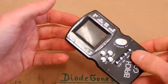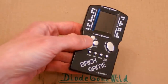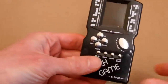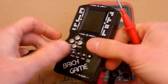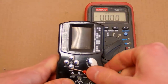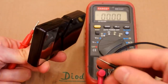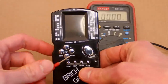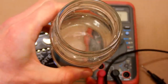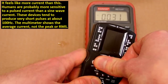This is a small object with almost no capacitance and it's not connected to ground, so it can't rely on capacitive current. When you press any of those buttons it gives you a shock. There is an on/off button which the user is probably going to press first, and it gives shocks. Let's set my multimeter to milliamps AC and connect one probe to this electrode and the other one to some button — it reads 3.5 milliamps. But through the resistance of a human body it shows 0.12 milliamps. That's not too much, but if your fingers are wet it's going to be more current — and now it is 0.3 milliamps.